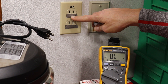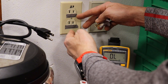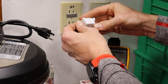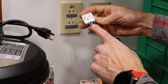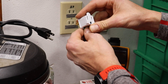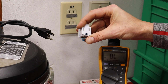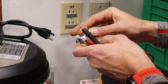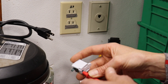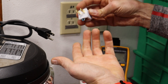What happens if I don't have that grounding socket on my outlet? That means I don't have the grounding protection and the wires running through my house to provide that for my device. When these adapters are utilized, the most common thing that is missed is on the underside there's typically a tab that is connected to the grounding terminal on the back. If I do a continuity check from here to this green tab, you can hear my electrical meter beep, and that tells me that this pin and this tab are bonded.